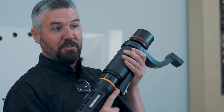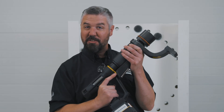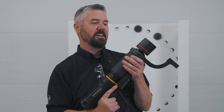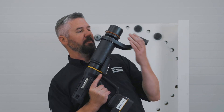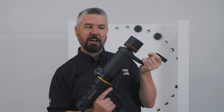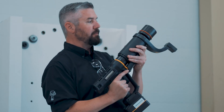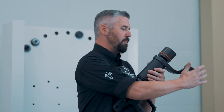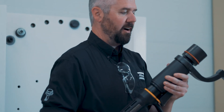So I've got this tool. This is the Atlas Copco SRB 3400. It's capable of tightening some very large bolts up to 3400 newton meters of torque. This is a direct drive tool. That means that we need something — aka a reaction bar — to take the torque reaction from the twisting force that we're putting into the bolt. So when we have something like this, we really want to make sure we're paying attention to pinch points in contact with the reaction bar.